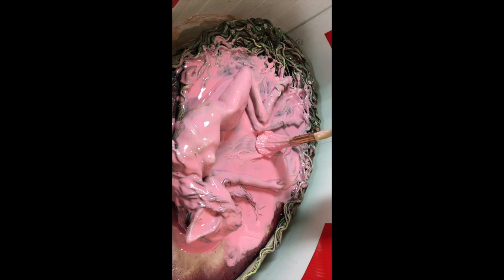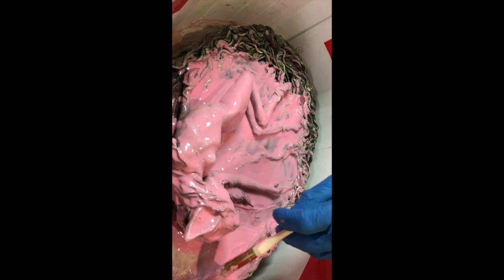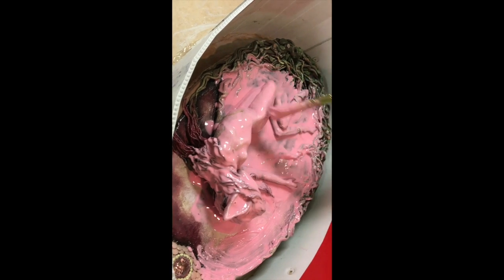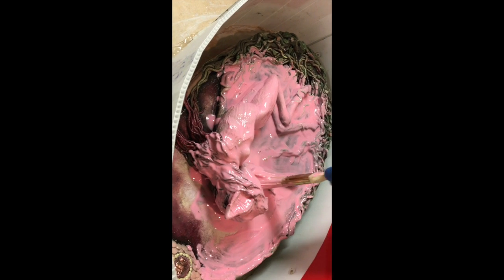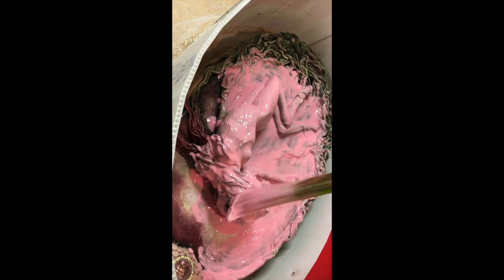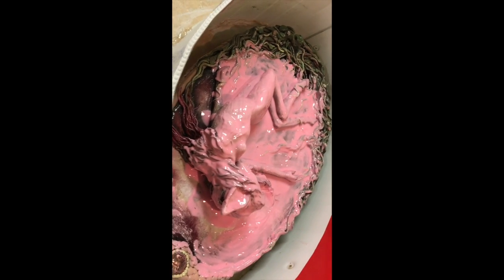The material is pulling — that's not ideal, but you might as well put it to work. We're trying to capture detail here. It has to be a real thin coat — almost a film — so be it. It's going to naturally pull and find a level place, just like any fluid will. It also gives bubbles a place to hide. This hair is real intricate and it's going to trap air, but still — fight it.